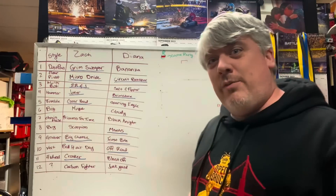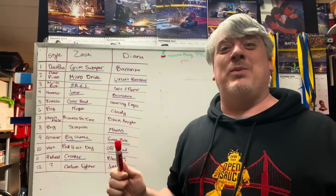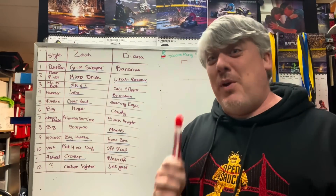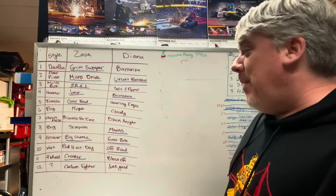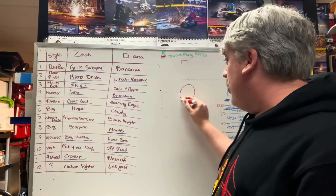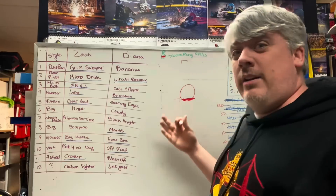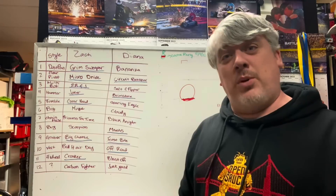I love my wheels — they push everything. Everyone always wonders how many magnets we're running for our wheels to work so well, but until last season there were no magnets and the wheels worked great. The problem with that wheel is it's very squishy, which is what gives it so much traction because it bites the ground really well. But it's terrible for magnets, because when you put a magnet on the base of the robot, the wheel squishes and then the magnet's dragging, and you have poor performance.